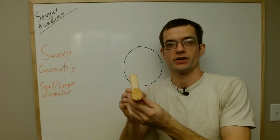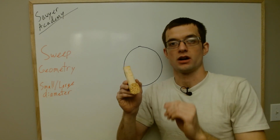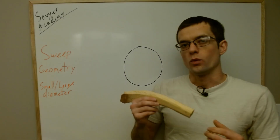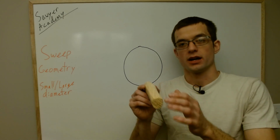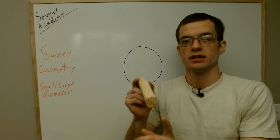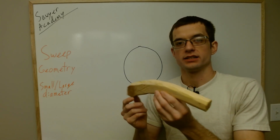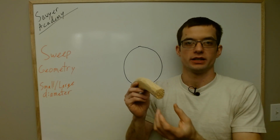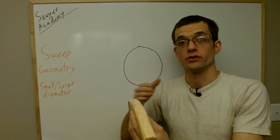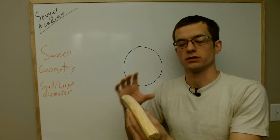In this case, we're going to be having a vertical saw. So we want one of these faces to reference that vertical saw to start on face one. So either belly up or horns up. Why we want horns up or belly up is that way after our first and second face, that will define what our cant size for this log is going to be. And since these two parallel faces are generally the same size, after one or two sideboards off of each, we're going to end up with a cant size that is the full length of this log.